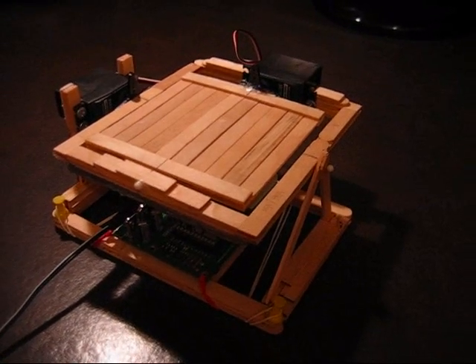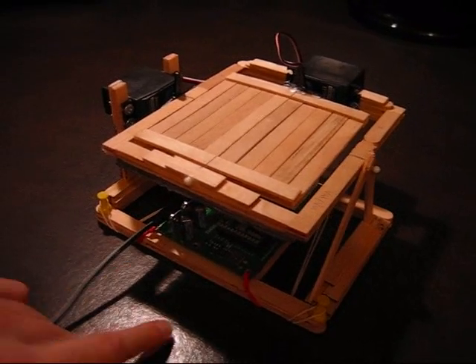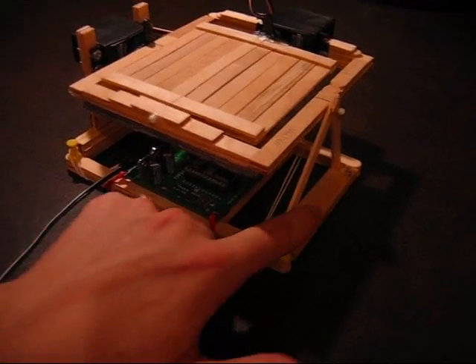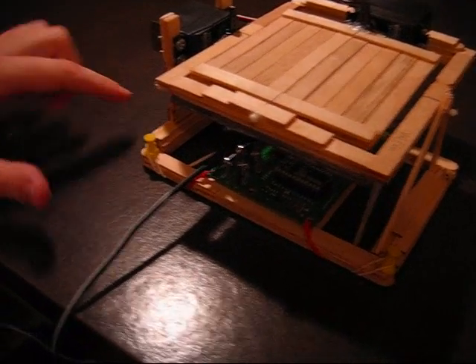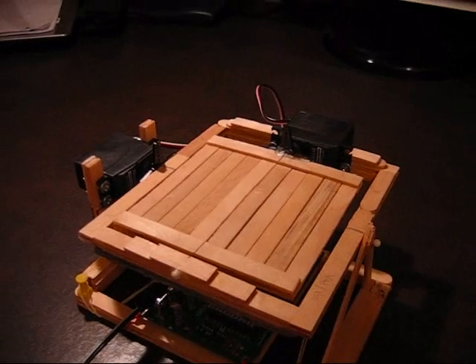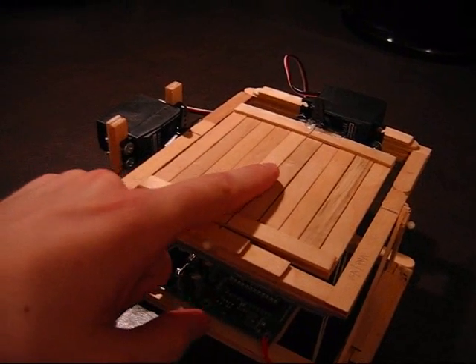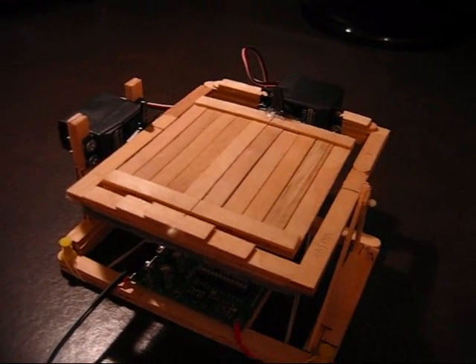So the next step for the project is to actually create the autonomous vehicle which we're going to mount the platform on. To do that, we're going to essentially just mount two servo motors, one on the right and one on the left. And then in the middle of the back we're going to have kind of just a frictionless wheel that follows the front too. For sensory input for the navigation we're going to have the ultrasonic ping sensor mounted on top, and that's kind of going to be the eye of the vehicle.